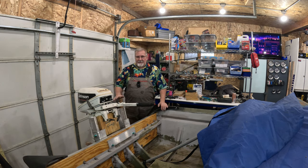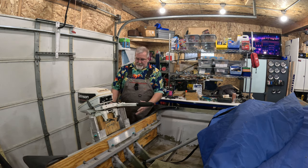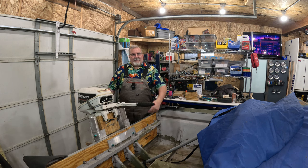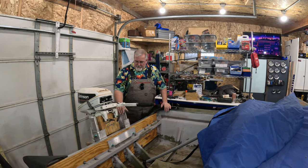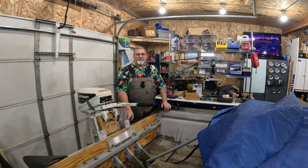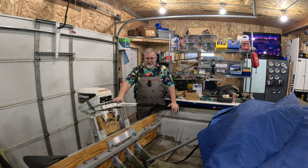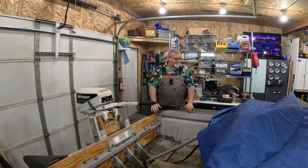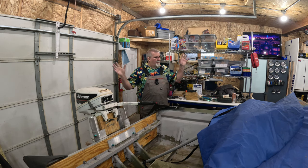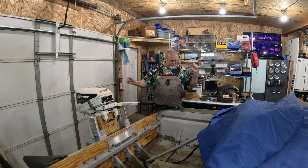There's always those different things you can do. Now, the other thing about this one here, I can actually adjust the trim because on the long shaft here, I can reach back here and I'm not reaching down below the boat while I'm in the water. I would be if I'm down on a short shaft, but the short shaft is still going to ride me about 3 inches above where the normal short shaft would run. So there again, accessibility to stuff back here is improved, right? But okay, I've got nothing else to talk about on this. I'm done. I'm happy. This goes outside.